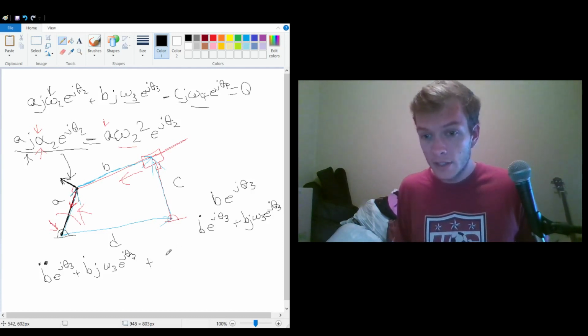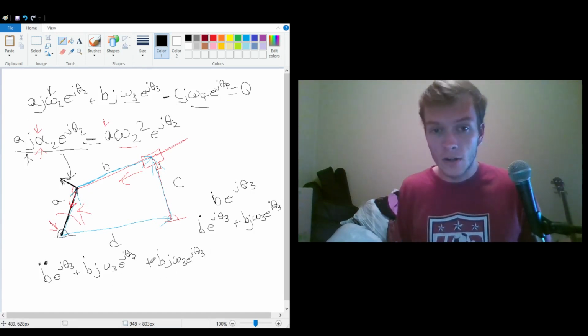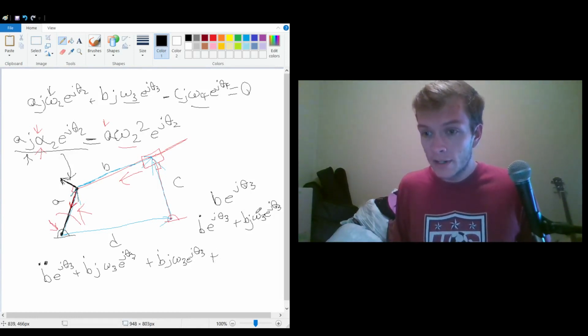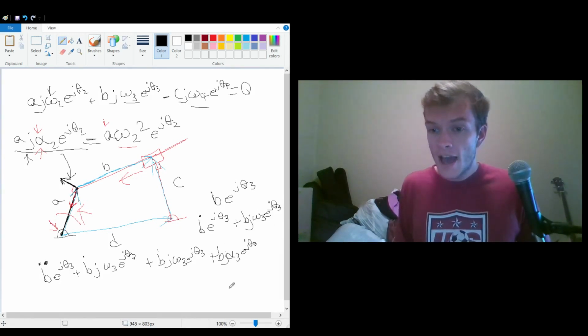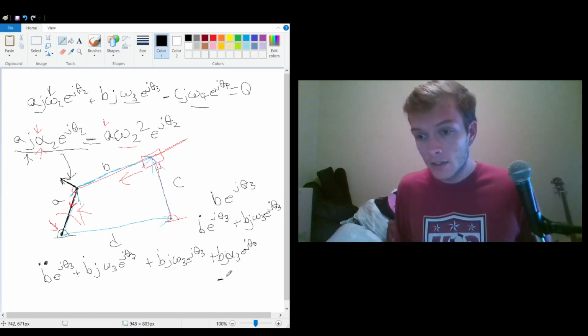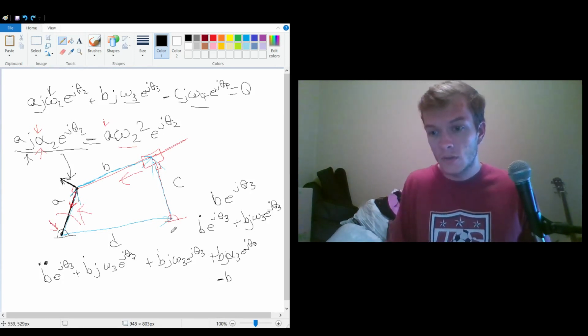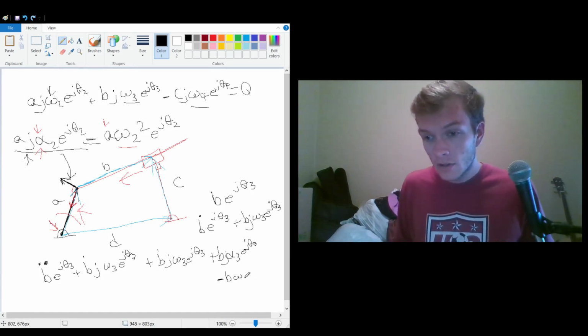and we're going to have plus, we're going to differentiate b first, so we'll have another b dot j omega 3 e to the j theta 3. Now these are the same thing, I'll get to that in a second. Plus we're going to differentiate our omega, so we're going to have our b j alpha 3 e to the j theta 3, and our final term I'm going to write below here is our inwards acceleration. So that's going to be b omega 3 squared e to the j theta 3. There is no j in this term because we've put the negative sign here because there's j squared.